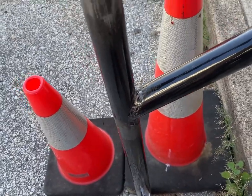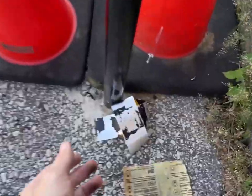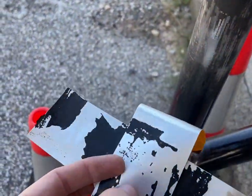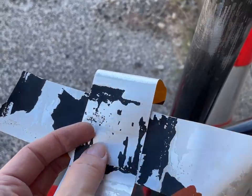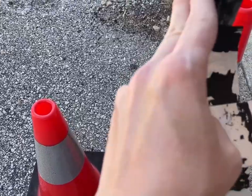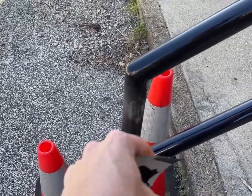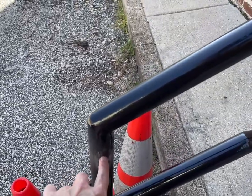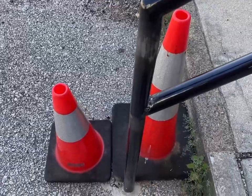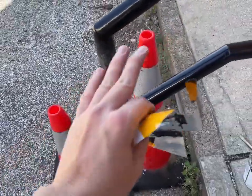I also realized there were other mistakes going on here, because I tried removing the stickers and they removed the paint. The glue on the back of this tape had melted its way into the enamel paint. So that's an even bigger mess — I had to scrape off a gooey paint mixture; it actually liquefied the paint. Then I sanded it. So I'm going to have to repaint all of this. But that's okay — I'm about to paint it anyway.